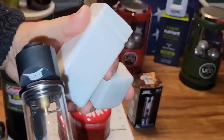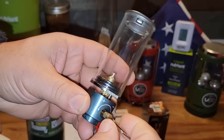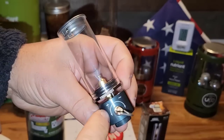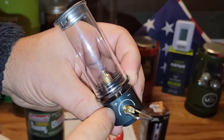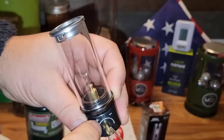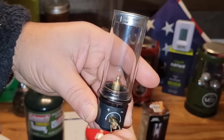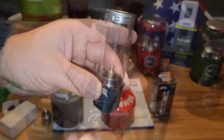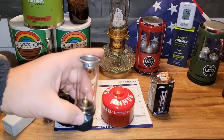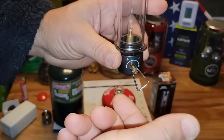The instructions are no good unless you can read Chinese Mandarin, so I don't even bother showing them to you. I've used it a couple of times just to familiarize myself with it. It has a minus and a plus sign — to close the valve all the way, you bring it to the minus, and to open the gas valve you go to the plus. Let's go ahead and attach this to the butane cylinder and see how it works, making sure it's all the way to the off position first.